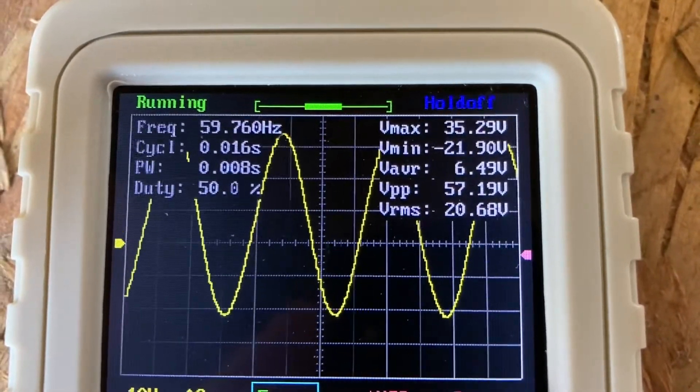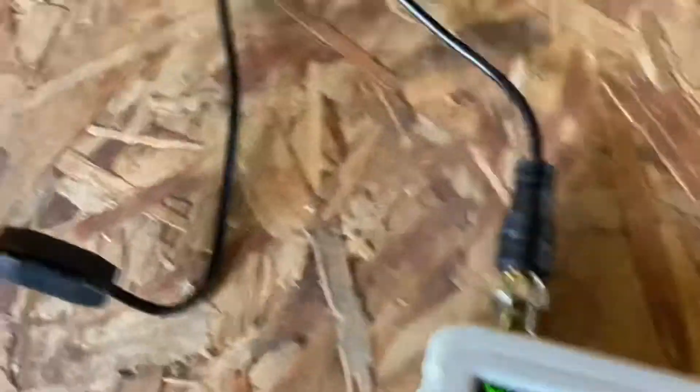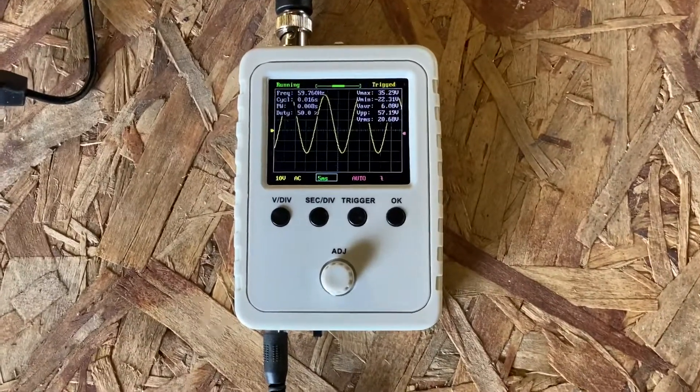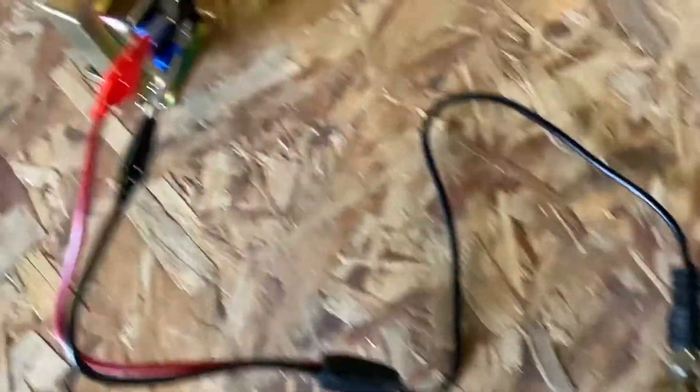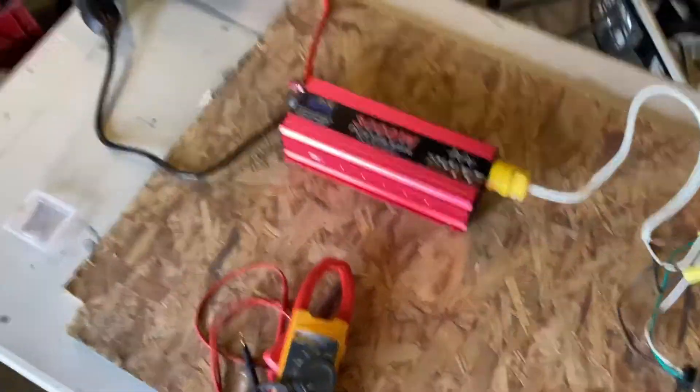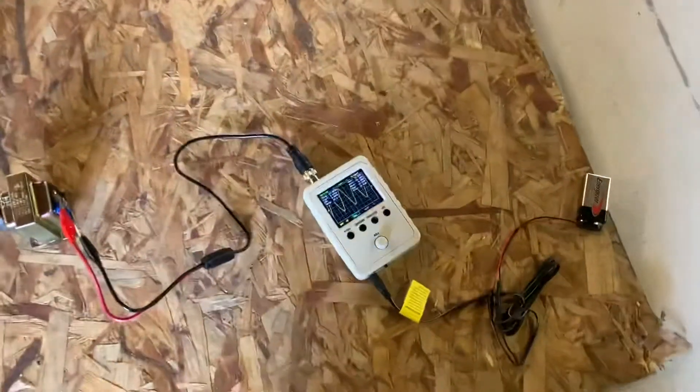It gives you an idea of all the different voltages. I had to use this little doorbell transformer because the maximum input voltage on this oscilloscope is about 50 volts, and I just didn't want to take any chances blowing it up. I'm lucky I had that laying around. So that's basically what I was testing — I just wanted to make sure that the oscilloscope was going to read the frequency correctly and that the inverter was actually producing a half-decent frequency, so I wouldn't be afraid to plug any appliance into it. Maybe with some better batteries, something a little more stable. Low voltage sometimes can do goofy things with the inverters, but I would be pretty happy with that for the most part.